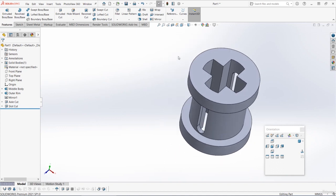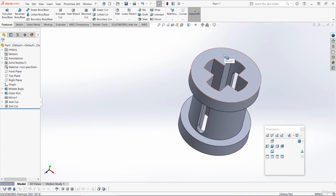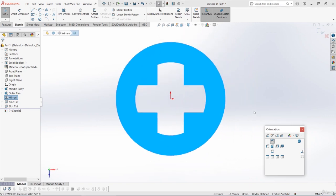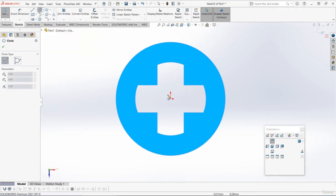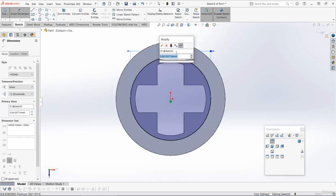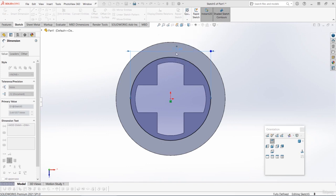And then the final thing we're going to do is just cut away that scalloped circular cut at the top. Only one end of the bush has these cuts. So I'm going to start a sketch on one of the end faces, either one, it doesn't matter. I'm going to go normal to. And these cuts are a little bit tricky to measure in real life, but I measured the shortest distance between the cuts. So first, let's draw a circle at the origin. And the size of that is 6.4, and that represents the shortest distance between those circular cuts.